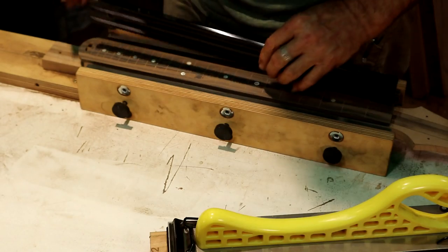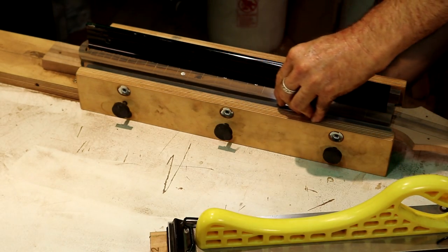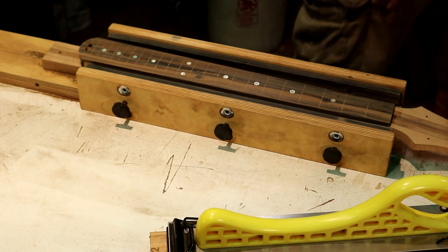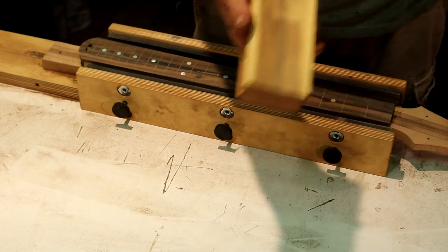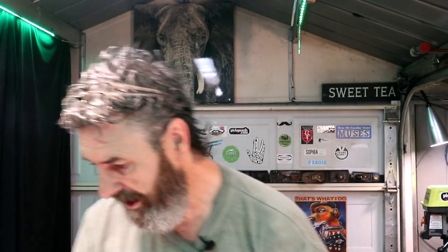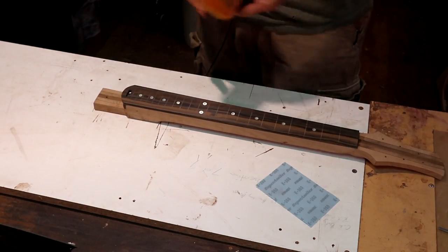I'm going to check for flatness with our straight edge. I don't see light anywhere on that fretboard — that tells me first of all I did a really good job cutting that radius in, but what it really tells me is Steve's the master when it comes to making killer accurate tools. That's beautiful, I love it. I'm going to take my Super Acolux sanding block with 240 on it — it's like a fabric with a special coating that makes the sandpaper last a really long time and gives a killer finish.